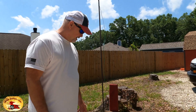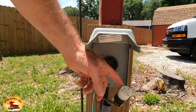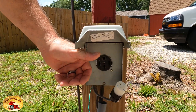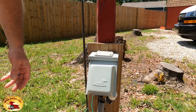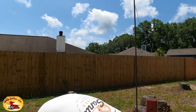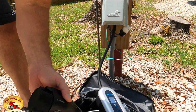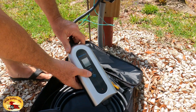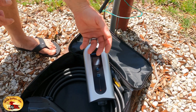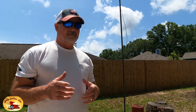This is the plug-in for the Beaver right here. This is an extra plug-in that I wired in so I could have 110 out here — when you do 110 off 220 you just use one leg. So say your family member shows up and they're out of power in their rig — pull this baby out, plug it in right there, they plug that into their car, boom. They can plug in and charge up their vehicle right at your home.